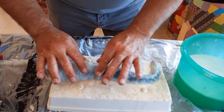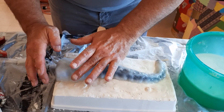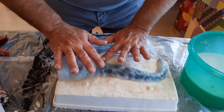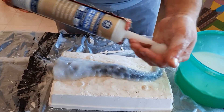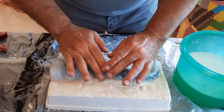Remember, you've got to work at a certain rate because it will get a skin. RTV is room temperature vulcanization — that's how it works. This is tin-based. Platinum-based is for food or body casting, and the price goes way up for the platinum.